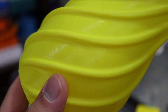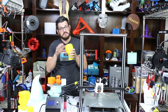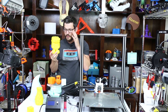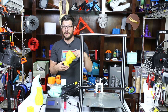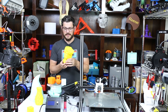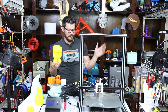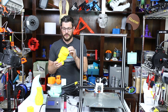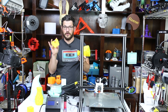I think this one I was actually a little too fast and a little too hot, so I actually started burning some of the filament — there's little black parts here and there. But overall I was happy I was able to get it done. I did start printing the 3D fill which I've actually never printed before and it was going great, except I ended up putting in a roll of MakerGeeks filament and turned the temperature up to 250 but it still jammed. That filament is hit and miss — this roll that I grabbed is kind of junk. I think it's just that filament not being so great combined with a crummy extruder.